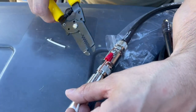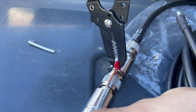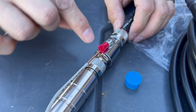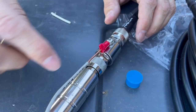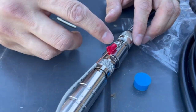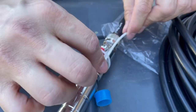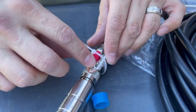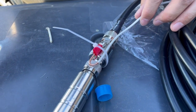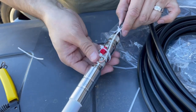What we're going to do is clamp it with our wires, squeeze it, and it should fit right on there. We just tightened it — you can see I'm tugging on it, but I do want to secure it. It's going to look a little finicky, but we're going to put some zip ties on it just to make sure everything's nice and tight. It's very tough to put these grounding wires on these arresters, but as long as metal's touching metal we should be good to go. That is the first zip tie — we're putting everything in place.